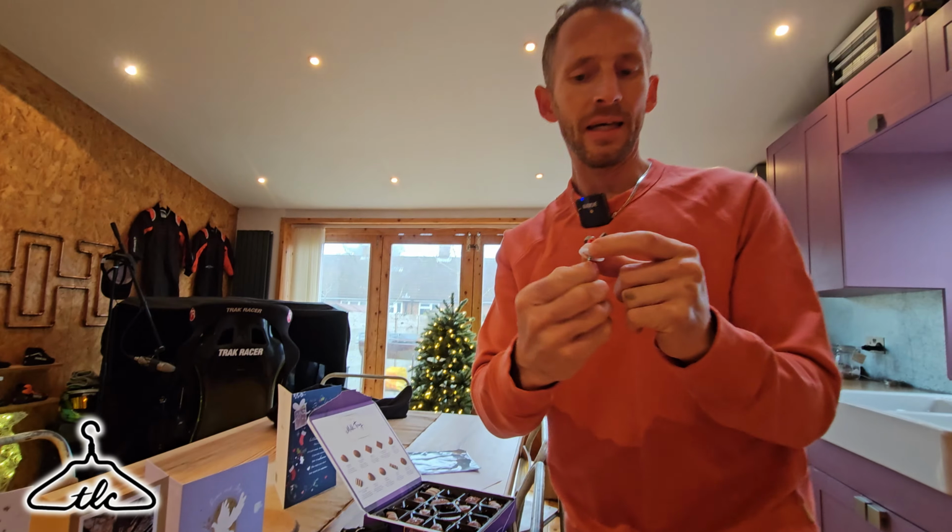So when you tighten it, maybe use a screwdriver, or if you're handy with a drill, just know the torque settings of your drill, and you can feel it with your finger as you're nipping it up. Don't over tighten it. It's not designed to be rammed in like a rawlplug, but they are fantastic. They got me out of trouble because I've never used anything like this before. I've used corkscrews before, which are great, but they can pull out the plasterboard.